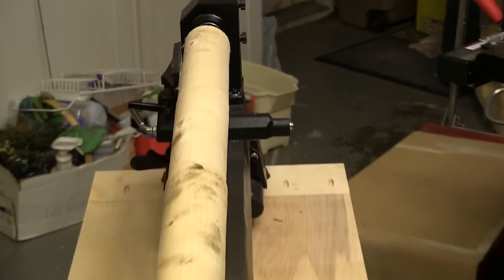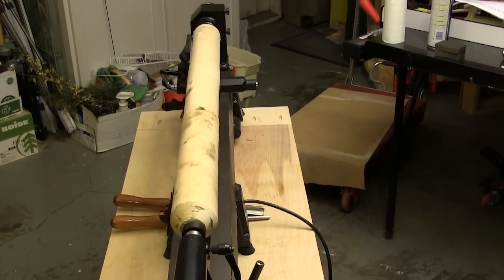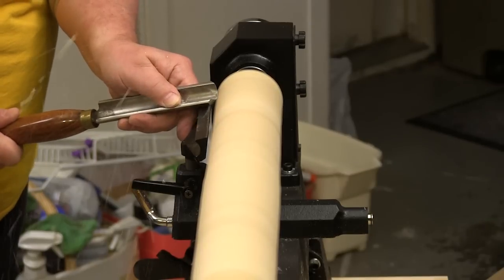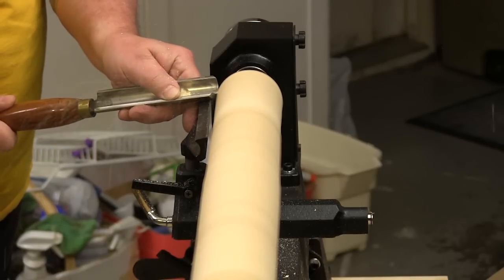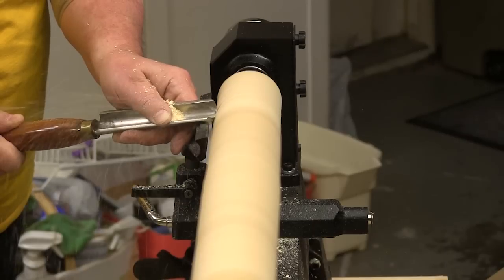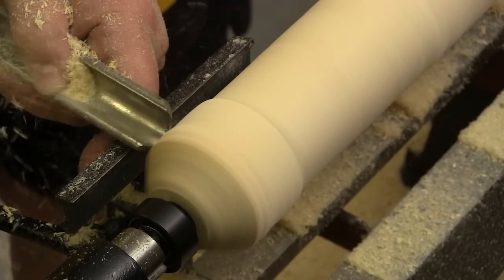With the bed extension installed and checked out, I mounted up this 38-inch long piece I had from another lathe test years ago. Since then it warped a little bit, but that's all right — we need to see how the lathe works with a piece that's out of balance, because not much is going to be in balance when we first mount it up. I'm spinning this piece pretty fast because I want to see how much vibration the lathe will pick up. I can feel the intermittent contact in the tool itself, but there is no vibration in the lathe. As I get the section rounded, the tool feels nice and smooth — you can see this piece was quite a bit out of round, but it's coming right back in and everything's nice and smooth.